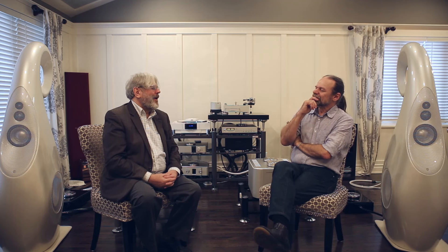We did that and a new optimum emerged. We have a carbon fiber hoop at the neck where the dome meets the cone, and another on the final outside diameter — on the rear side of the diaphragm, not visible. In the original driver there was a breakup at 4k that was very difficult to spot, but the first one that really shows on measurements was at 5.8k. The new driver's first breakup is at 10.5k — a very useful improvement. So increased power handling and increased bandwidth, well out of band. This is the process of going around the loop, taking out primary shortcomings and then coming around again asking what the next biggest problem is.